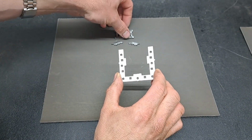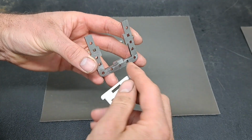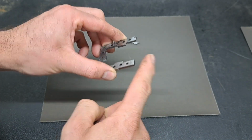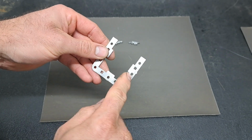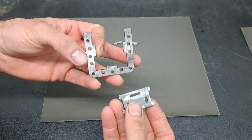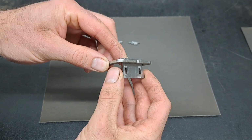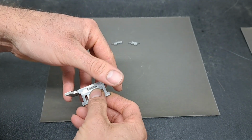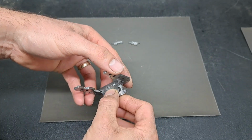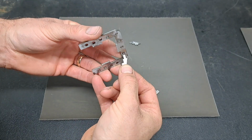There is the frame mounting U shape. The first thing we've got to do is, on sharp corners like that one, you always get a little bit of a tag left. So on these, you've got a little tag on each corner that needs to be filed off. So that's the first thing to do. And then just double check that it slots on there nicely like that. It doesn't want to be tight, but also it doesn't want to be really, really loose. So that's quite nice on there. I quite like that. And then we do the same with the top gussets. And they should...